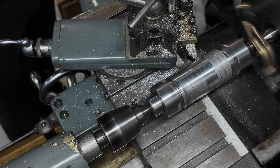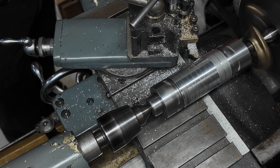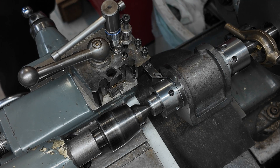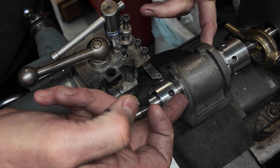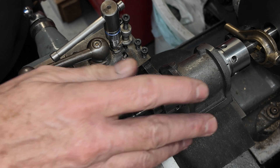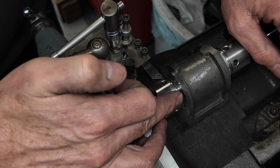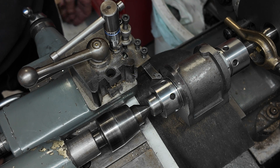Before the final stage of trimming the cylinder ends, I take another cut to make sure that the lapping hasn't upset anything and to make sure it's still concentric. We've finished our lapping and now we can bring the ends of the cylinder to dimension. I measured the ports on the inside and this end — the end I've marked with black texta — is 22 thousandths too far down. So we're going to start by evening things up.